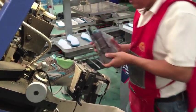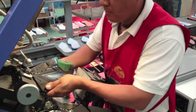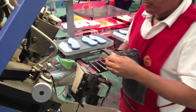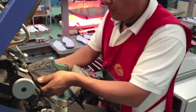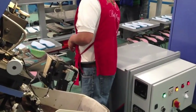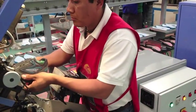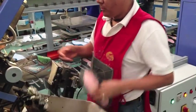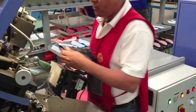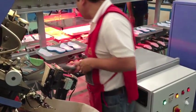Another example of productivity rising is shown in the following image. The toe lasting process in this footage has an output of over 200 pairs an hour, because they don't have to use an external machine, so we eliminate any unproductive time. The assembler simply carries on with their optimal pace according to the required quality. In addition, the effective steam emission of this equipment reduces the need for ironing because it eliminates any possible wrinkle in the lasting process.